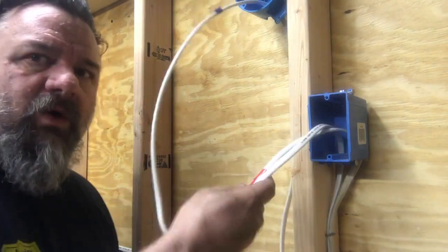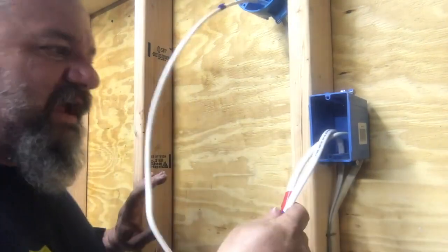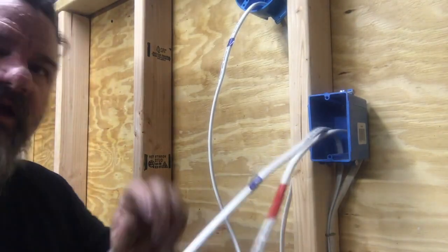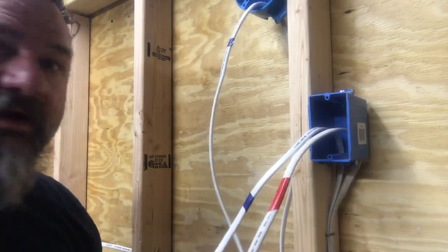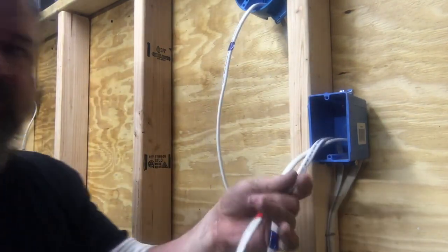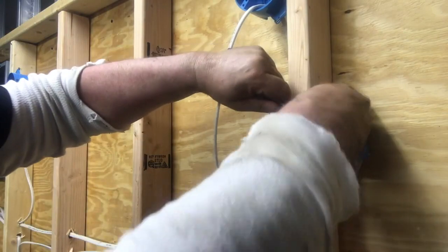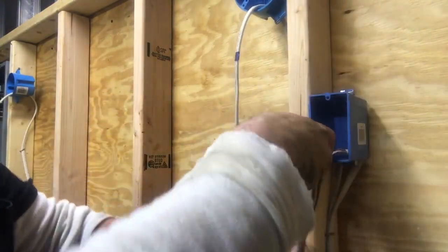This side should be easier — you only got two wires. It doesn't make it easier though. You could have a 20-gang box, so long as you know that this is the other end. See this blue? This is the one that just comes out of this box and goes up here to this light box. This is my three-wire from the other side — simple as that. I don't need to mark this, but if you had other boxes in there, put my notches in there so I know that this is my switch leg for the three-way. Cuts on both sides — pull it off. Just a little nick — you don't need to go down deep, you don't want to hit the wire.